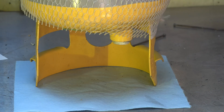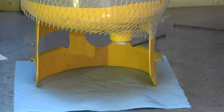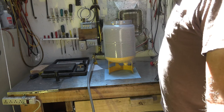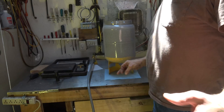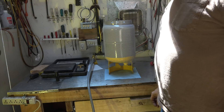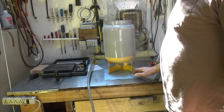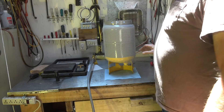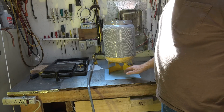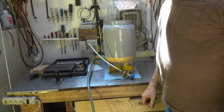For those 30 or so recoveries, I've got maybe half a teaspoon of oil. I'm not saying oil doesn't come out with liquid recovery — the oil does have to travel through the system — but I think a lot of people overstate it and believe they're removing massive amounts of oil every time. I get a lot of questions like, 'How much oil are you removing? You're going to destroy the compressor.' Thirty recoveries and I've got half a teaspoon just coating the inside. I'm going to do the same test on a scroll compressor since they tend to pump a little more oil, but I don't think I'll find much. Even with removing the valve, there was nothing significant in this cylinder.